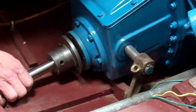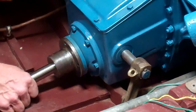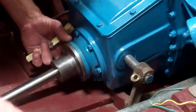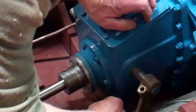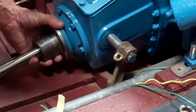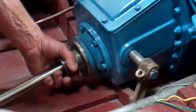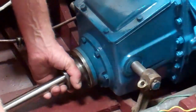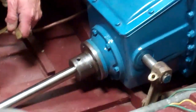What we came up with for a problem is everything was so tight. I don't know if this was a homeowner installation at one time or not, but we were having trouble lining the engine up. You're supposed to be able to stick a feeler gauge in the bottom and the sides to make sure you have the same amount on the bottom, top, and sides. We've been moving the motor up and down, around, prying it sideways, and then we decided we needed a little more clearance in the keel, so we had to do a little bit of work to the keel.